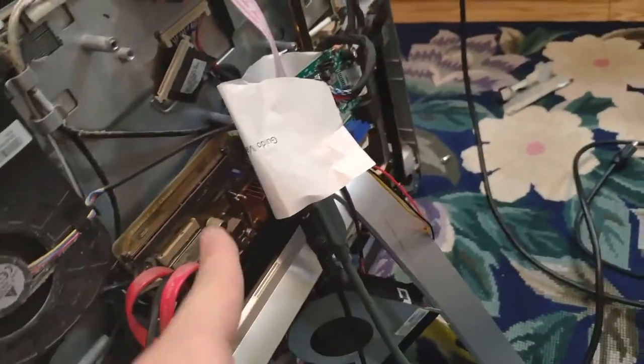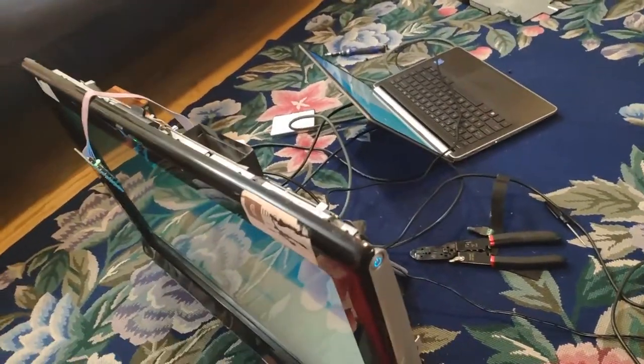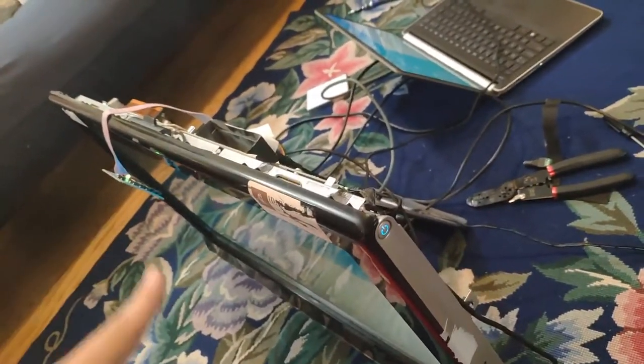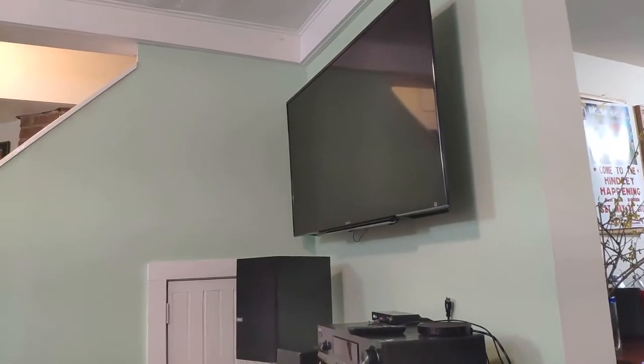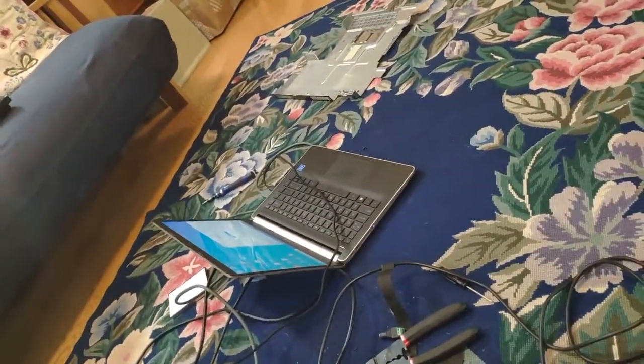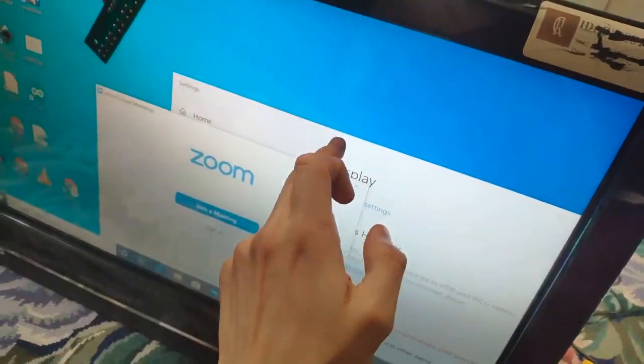Going into the LVDS port here, and you can see the LVDS cable from this computer unplugged. This computer has DVI, and that could theoretically go back into this driver board, but this computer seems to be panicking that it doesn't have LVDS. When I try it with this computer it just fades to white, which is strange, because it wasn't doing that earlier. It doesn't work with this — it fades to white. But here it's not fading to white, so I don't know what the difference is.